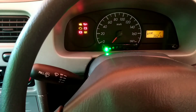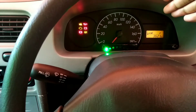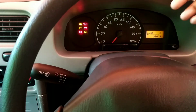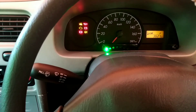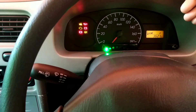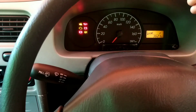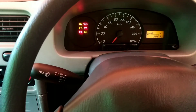The Arduino controls nine LEDs connected here. You could do this much easier with an RGB LED strip — I didn't think of that and I had individual LEDs, so I went with this. With nine LEDs, all the negatives are connected together and the positives separately, which means 10 wires coming out of the speedometer. If you use an RGB strip, it only takes three wires, which is way cleaner.